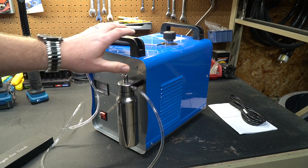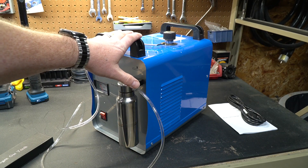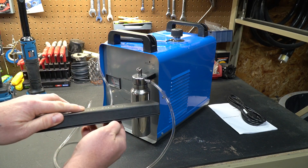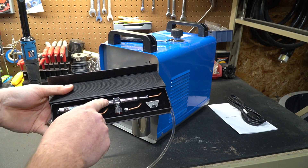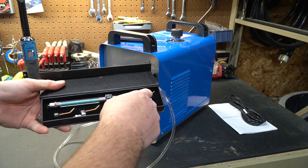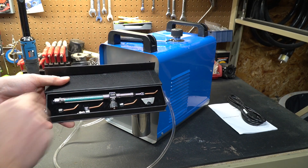I'm a little bit scared of some of this design. My fear factor encouraged me to buy a different gas torch, and this gas torch actually has a flashback arrestor built into it. The colorful sand jammed in the back — if there were a flashback, meaning I shut the valve off but it still made it through the hose — the sand would stop the flashback.